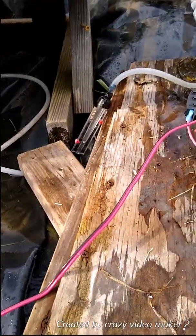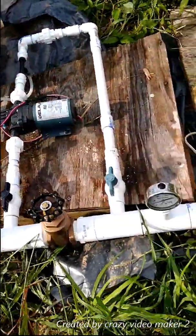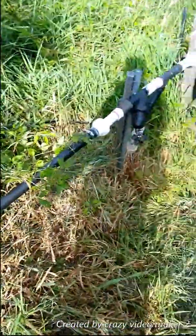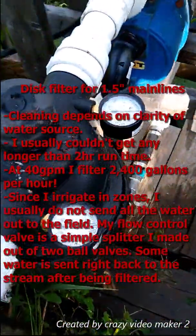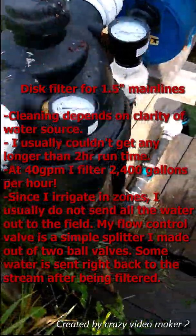It's a nice slow, even amount. This is now all going out with all my drip lines. Over here, first we've got the filter, and they've got two pressure gauges, so we know when the difference between them is 10 psi, it's time to change this big disk filter.